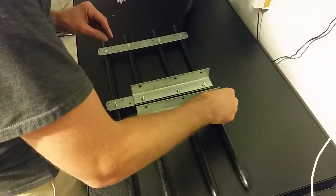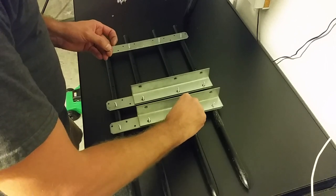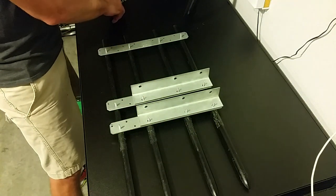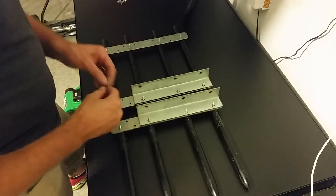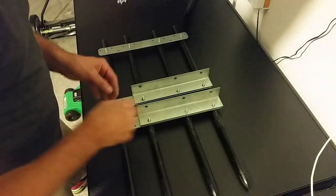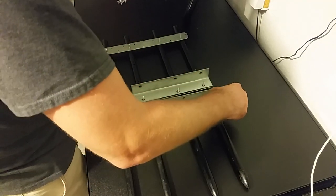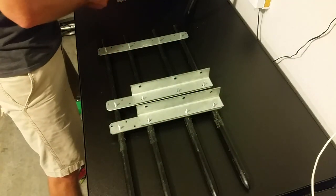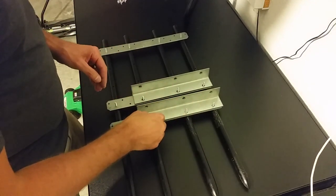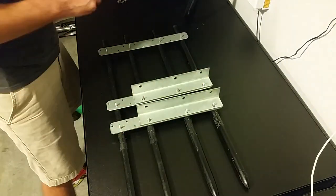You'll notice that the holes on the three-hole angles are a little bit bigger, so what I'm doing is stacking three of the number eight washers in there. I don't know that it makes much difference, but I did it anyway just to get that hole filled up and build up the thickness, since it's a bit thicker there than the strap on the far end that doesn't have the three-hole angles. So I'm putting three number eight washers in each of those holes, and on all the other ones just one washer. That brings the washers up to the level of the angle piece.